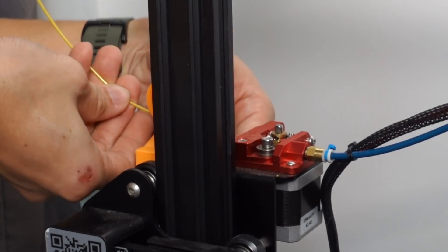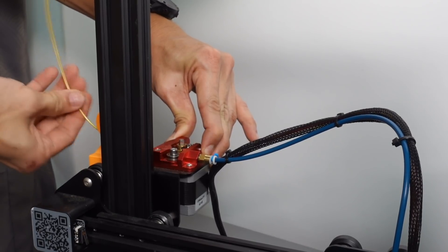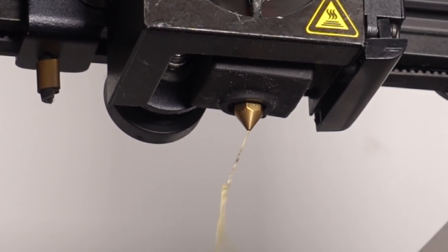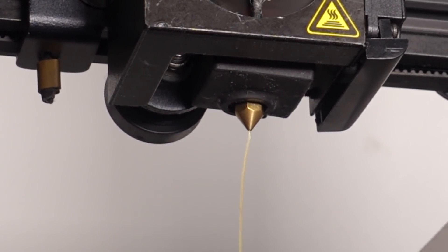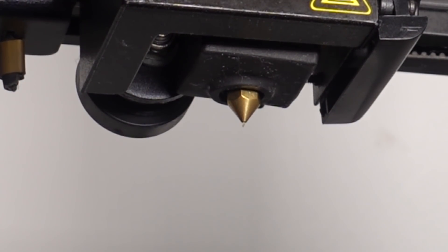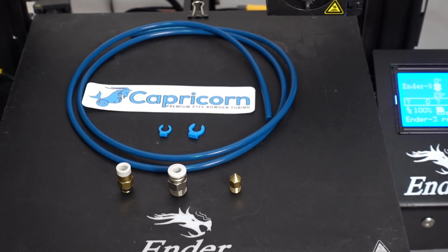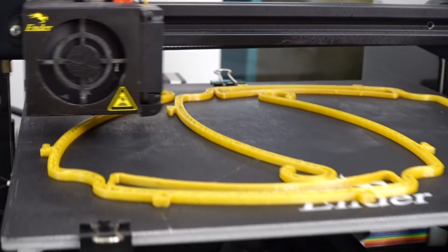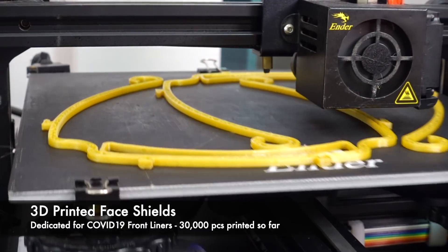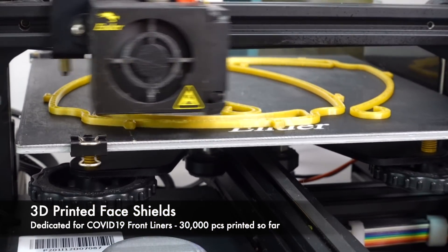Finally, just insert the filament. When you push it through, make sure that it's not having any resistance, and push it all the way through till you get to the nozzle — the filament should be extruded smoothly. The nozzle is extruding it straight and nice, and there's no stringing. Job's done. That's how I clear up the hot end, change the nozzle, and upgrade the PTFE tube. Now the printer is back into working mode. Hope you enjoy this video — please like, share, and subscribe to my channel, and do comment below to help me improve in my future videos.